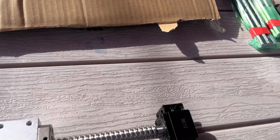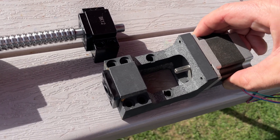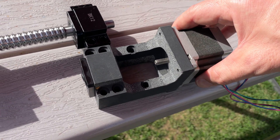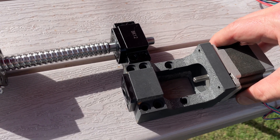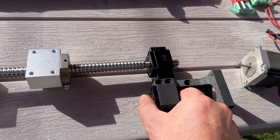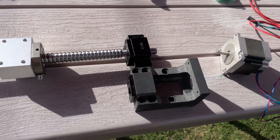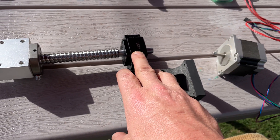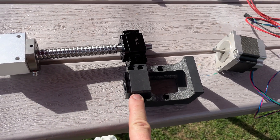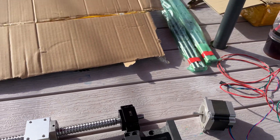These two serve the same purpose, but this one holds a motor — and you'll have a misalignment coupling that goes here, making it one complete unit. I wanted to buy a Misumi brand version of these, and I want to get all Misumi brand blocks instead of the Chinese ones because they come with angular bearings already press-fit in. These are deep groove ball bearings, which aren't really appropriate. This Chinese one was like 50 or 60 bucks; Misumi's version was $600.